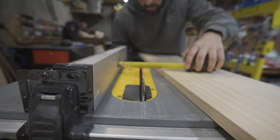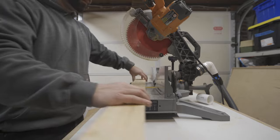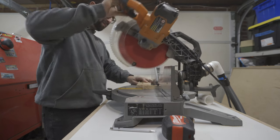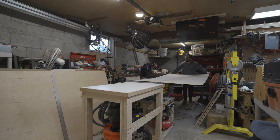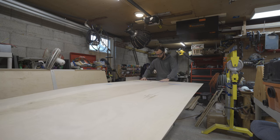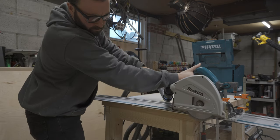So I have all the three quarter inch material cut. I ended up using a pine board for the drawers rather than the plywood because I didn't have enough plywood and didn't want to cut a whole sheet for a couple three inch wide pieces. I'm going to pull out some quarter inch material and get to cutting the drawer faces, door faces, and back panel. I decided to reference the model and mark out all of these quarter inch panels on the four by eight sheet of plywood to minimize waste and maximize what I could do with the leftover material.